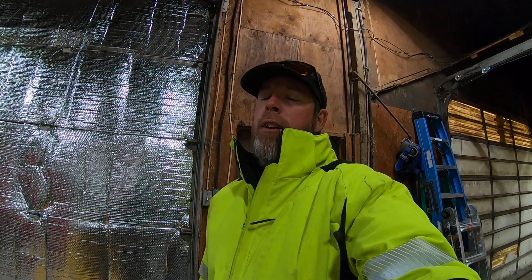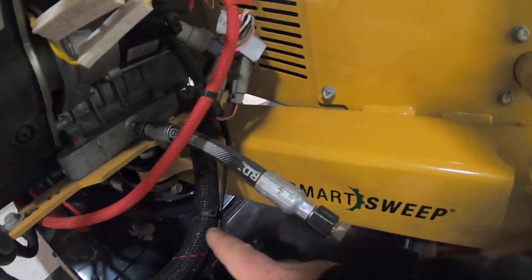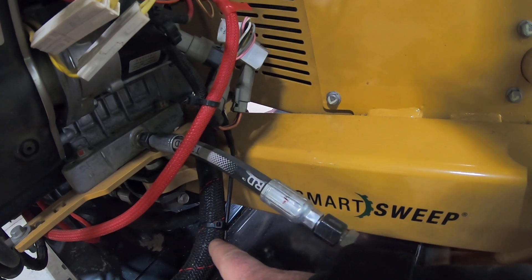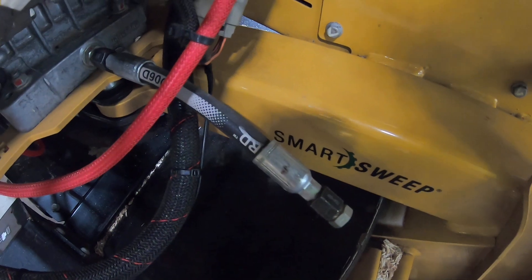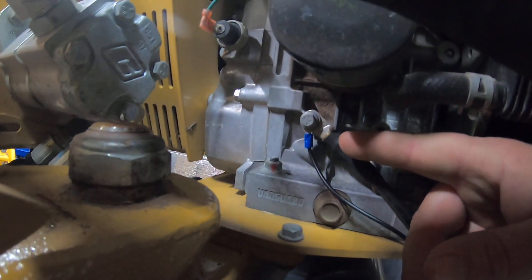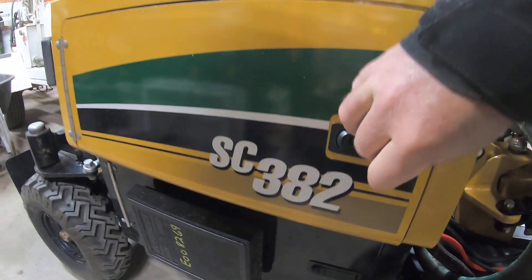What I did was come into this wiring harness right here. There's a plug back in here — you probably can't see it but maybe you can — that goes to your clutch. It used to come out of this wiring harness with a couple of wires. I snipped those off, patched into the plug, brought my wires back here, simply went to the ground right up in here, and then I have another wire that follows back and comes into here. That wire comes up through here, and I put a new switch in up in there.